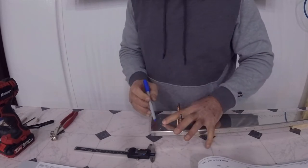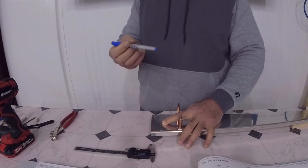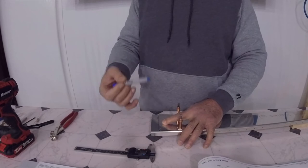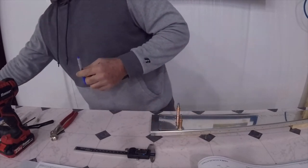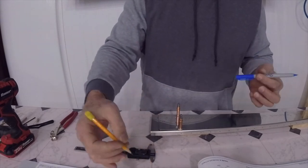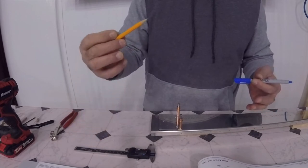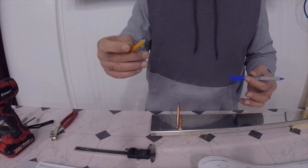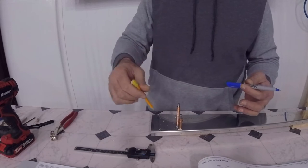I'm going to make my mark, and the blue sharpie does stay on the material better. Pencil is used to write things in your shop — it is not made to mark material. The carbon and lead from a pencil — you don't want that on your aluminum.